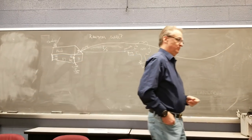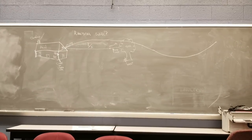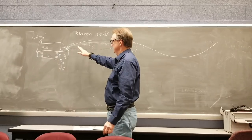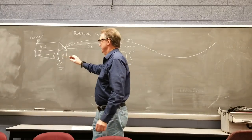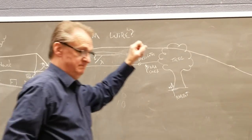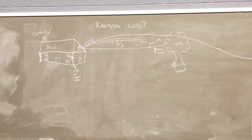Now, if you were to want to put up a one wire that's going to fit all the bands that you want to do, you want to find a length that will give you those multiples at any given ham band frequency so that you have your lower current point. Now, it may not be down as low as it is on one band. It may shift up and down a little bit. You'll see a shift in the feed impedance at that point. Yeah, but those multiples are what you do not want.